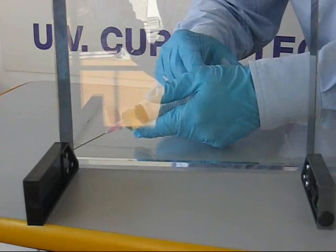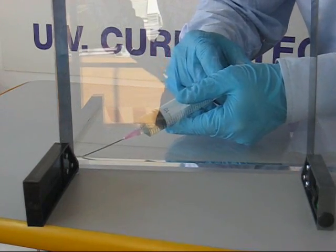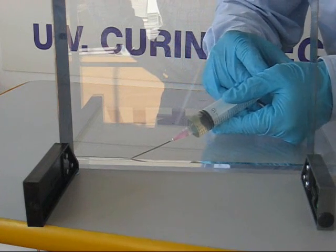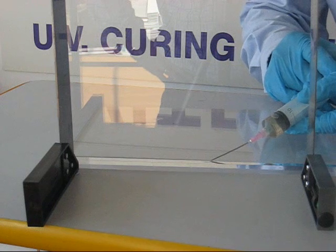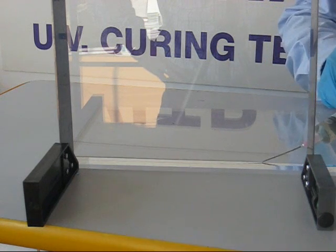I am now going to apply our UV adhesive. It's designed for capillary action, very similar to a solvent adhesive. The key thing here is that as a solvent, you need to fill the joint before moving the syringe. With the UV glue, you have a great capillary action and it will keep using that action until you've used the UV lamp to cure the adhesive.